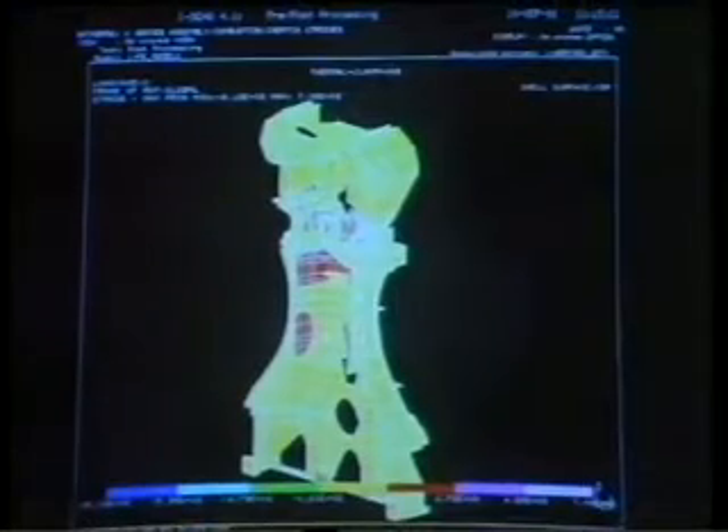The engine effectively bends as forces arising both within the engine and from the suspension are applied to it. Rover used computer analysis to assess the performance of the new design. A vertical slice shows the results of a simulation of the loads and stresses which a running engine would have to bear. Yellow areas are very lowly stressed, while red indicates some areas which are tensile, but acceptably so.